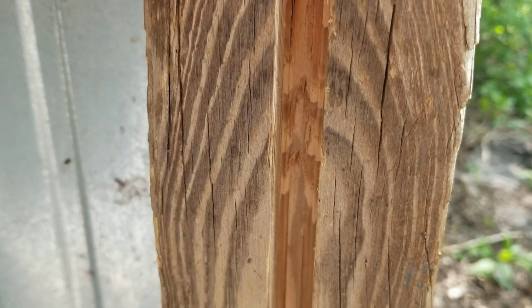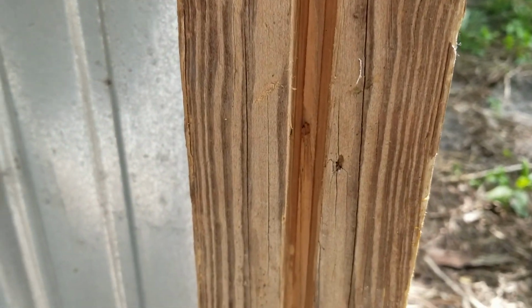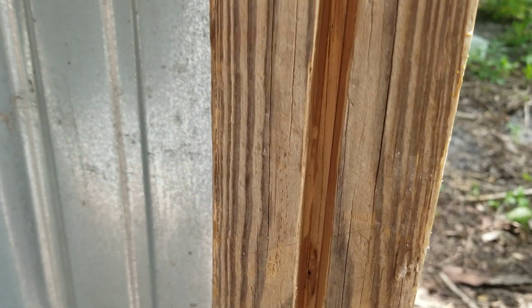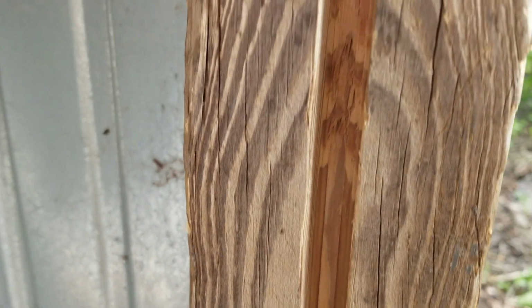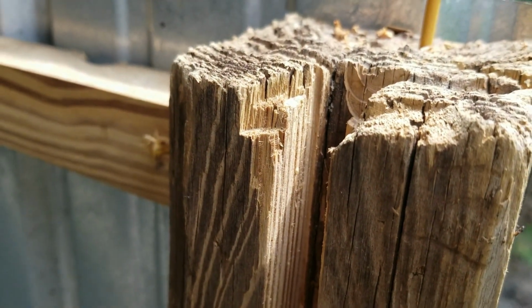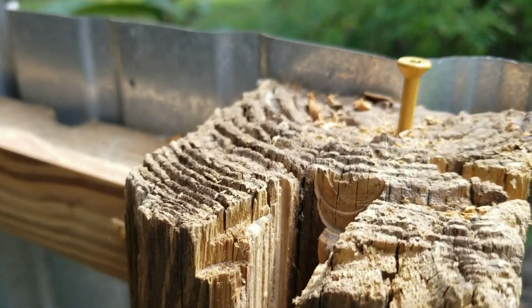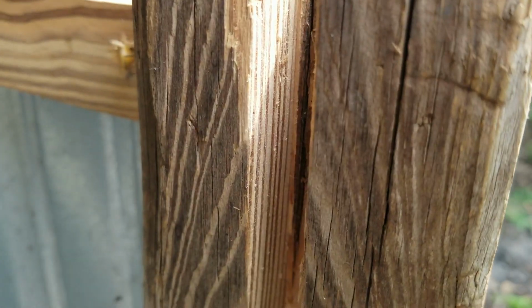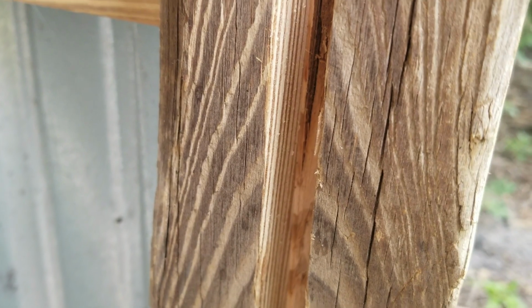We did the grooves with the table saw and adjusted it a couple of times. But you can use a skill saw if you have a good guide, or a router tool. The depth depends on what you're using to slide in, what kind of metal, if you can cut it with the hump part or the flat part. Experiment, make your own plan. This works well for us.